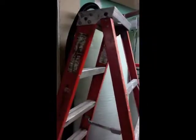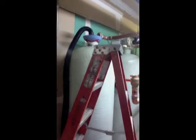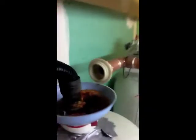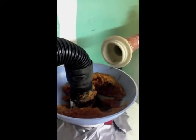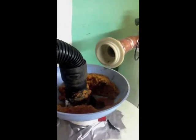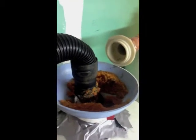You're wondering how you can get the resins in quicker, because 10 cubic feet of resins had to go into each one of these. First, we put in all the gravel with a modified funnel, because I didn't like the commercial black funnel — it doesn't leave enough room around the distributor for the gravel, especially the quarter by half inch gravel. So we made a modified funnel so there's more space around the distributor. We got all the gravel in, all the under-bedding's in. Now we're putting the resins in.